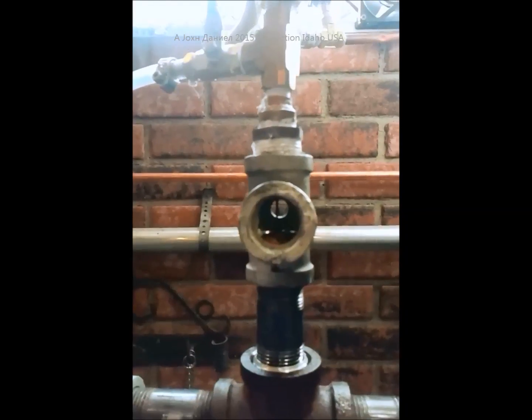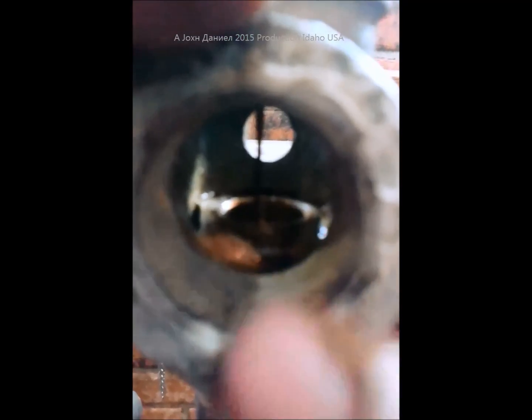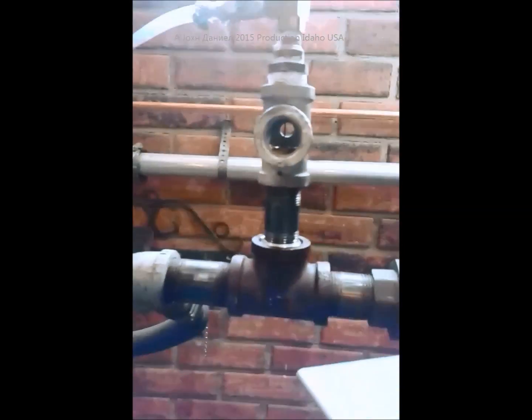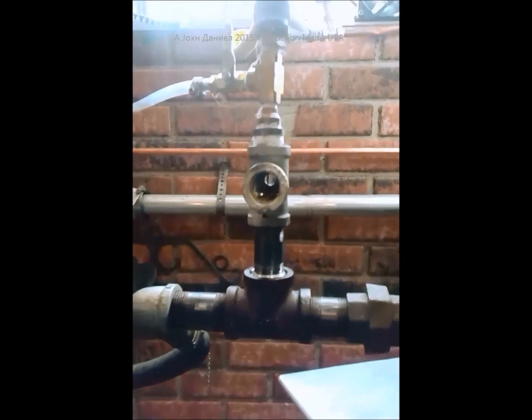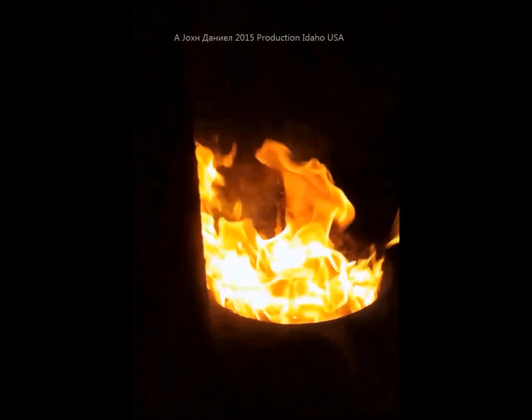Running at about the size of a mechanical pencil lead — that's about the size in there. What that is: it's a little brass cup that got brazed on to the end of a piece of 3/8 OD copper, and it's like a little funnel embedded inside of this with an epoxy. That worked perfect for this purpose, and she's starting to fire up good now — she's been burning dirty because she's cold but she'll clean up here shortly.